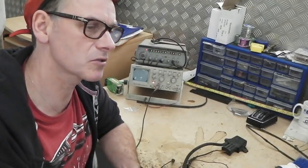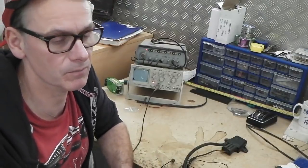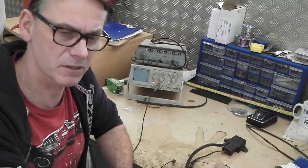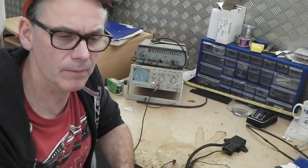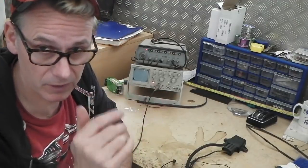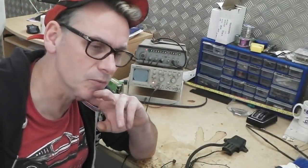That took a little bit of research, and Ruby hasn't got this feature. Ruby's torque comes on only with the cruise control, which gives you again a lot of the lockout features that I've got on this one, i.e. the brake pedal disengagement of cruise disengages the lockup. However, Ruby does not disengage the lockup when the cruise drops a gear, and the cruise can very rarely drop a gear when it's cruising uphill. It will knock down the kickdown, so you would get that harsh change. So that wants modifying. We need to add this switch to Project Ruby as well.